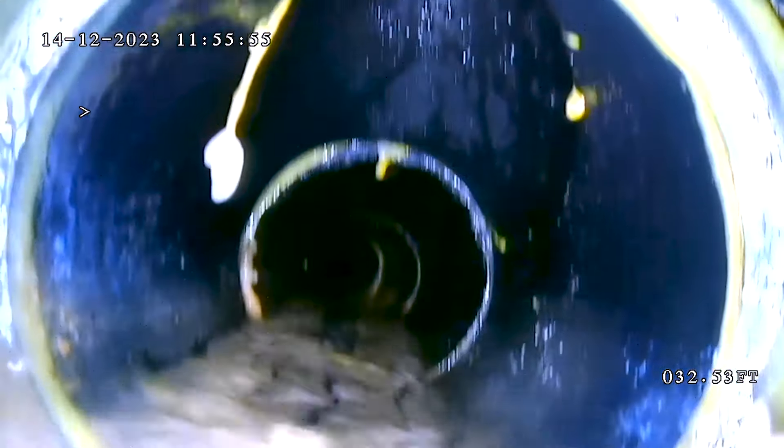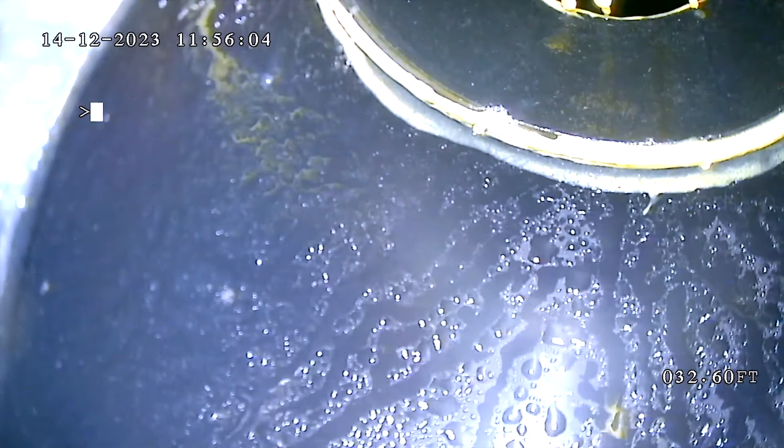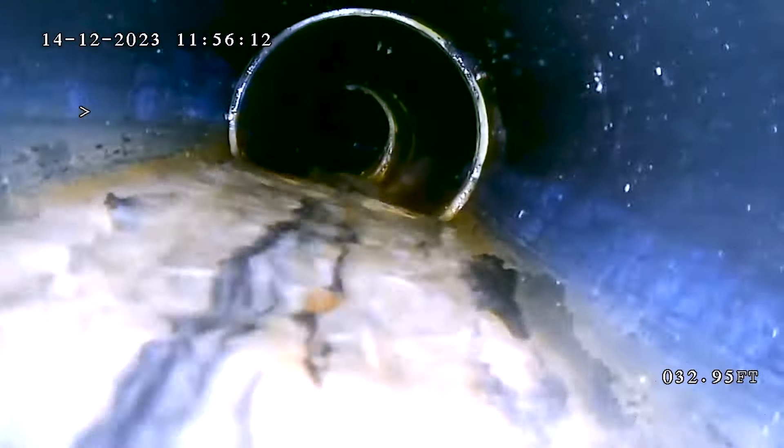This is another turn, and right here I think there is a clean out going into the yard. I'm going to rotate the camera up. Yes, you can see right here — this is actually a clean out going up into the yard because we had too many bends to get out to the city, so we had to do another clean out. You always want to keep the water on the bottom just to give you a good reference of where you're going.